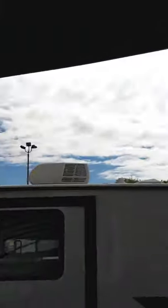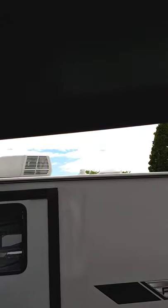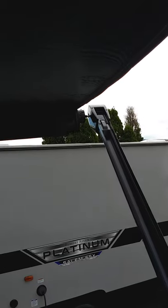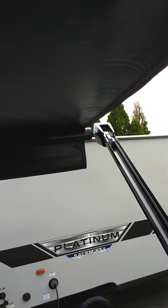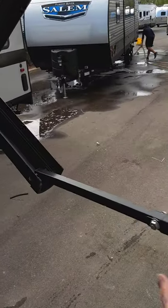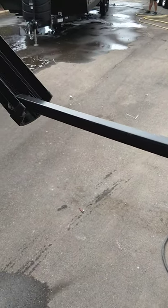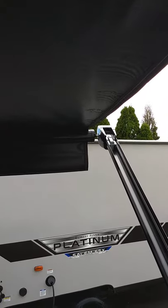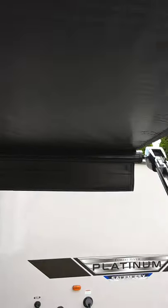You're going to extend your awning here just by pushing that button and holding it — you can see it's going out. You take it out until you can see the awning tube; it's a metal tube, so just keep an eye on it and stop when you see it. You can also pitch it by pulling down on here. You should always straighten it out before you put it in. Never leave this awning out unattended — if you're not at the campsite, you roll it in. Wind can come up quick, and a lot of pressure builds up underneath. It can get damaged in just seconds.